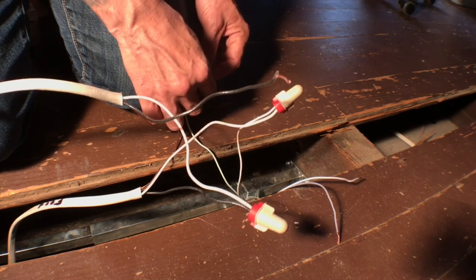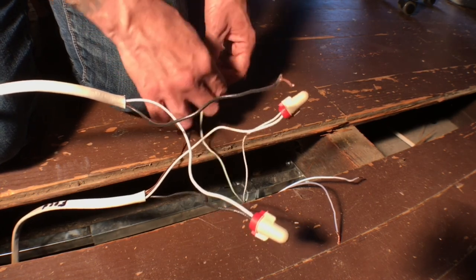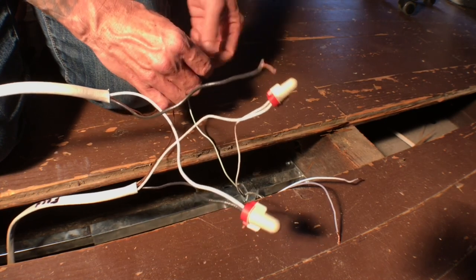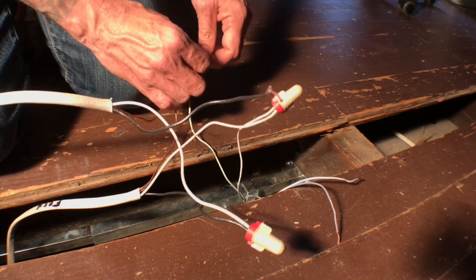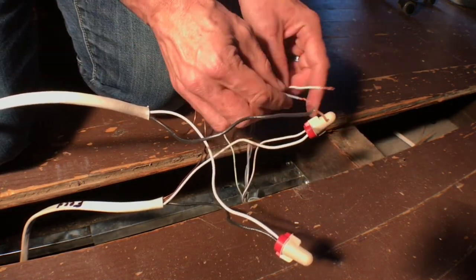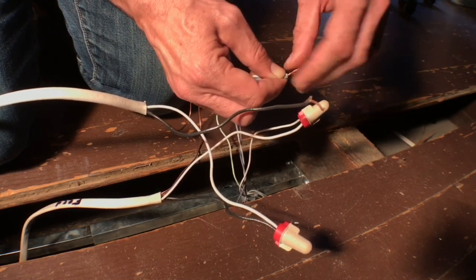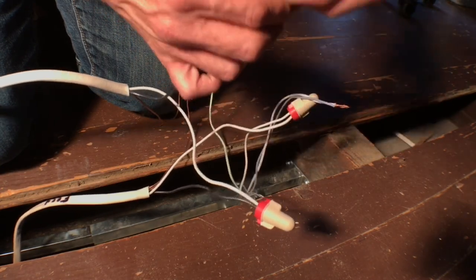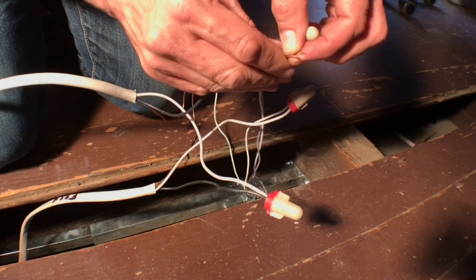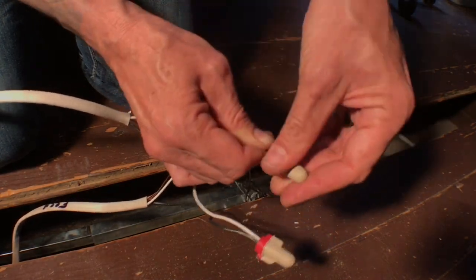I am not turning it on until I cap this ground — I'll keep that visible as a reminder. Now the last connection: we are hooking up the fan motor and the lamp — the black wire and the blue wire from the fan — to the black wire of the switch leg. This completes the circuit. Got that on there nice and snug.